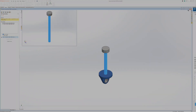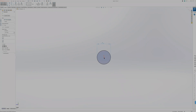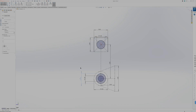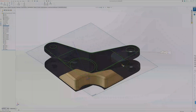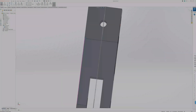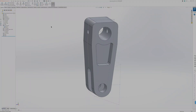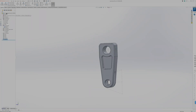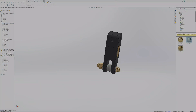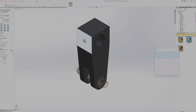The next thing I need is a heave spring. Since the center torsion bar is the pivot axis of the push rods, it is the load-bearing component, but right now I only have shocks attached — those handle damping. I need a little arm that attaches to the center of the sway bar and connects to a spring to support the weight of the front of the vehicle — that's a heave spring. This is super common in Formula 1 and road racing, but I've never seen it done where the torsion bar connects all three components together. Usually it's a much more complicated set of linkages, but I wanted to see if it was possible in this architecture.